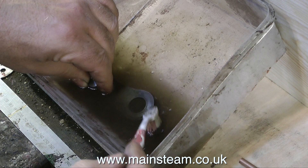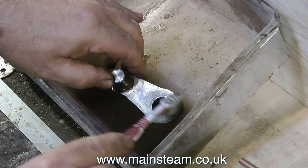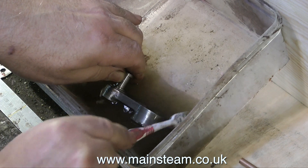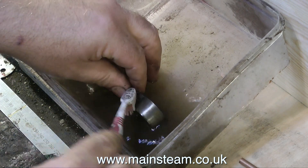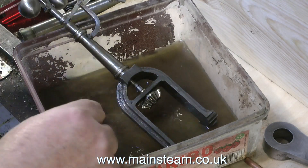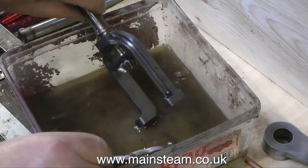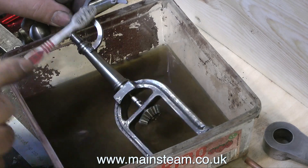After a bout of removing Gorilla Glue from between the small bricks, I went back to cleaning the parts for a while to see whether or not the glue would expand any further. Here I'm cleaning the crank web — I'm going to clean this up really well. Part of it's going to be painted and part of it's going to be left bare metal. This is the governor getting the cleaning and degreasing treatment; again, part of it will be painted and part left bare metal. It's not good to just globally paint all the parts — the engine will look over-painted and it will be spoiled.